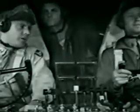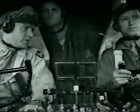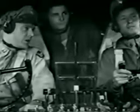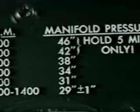What about the other power settings? Well, you've used 3, modified for 91 grade fuel. Takeoff power, 5 minutes maximum continuous operation, climbing power, and maximum long range. They're all there in the panel. The power setting used in normal cruising is always figured from your flight conditions. Desired range, fuel available, weather conditions, altitude, gross weight, and perhaps 1 or 2 other things.